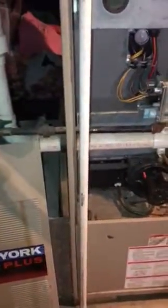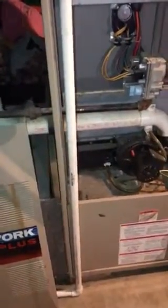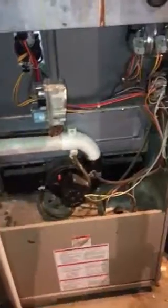So our return drop, I've got the dimensions on the return drop. Bring a vibration collar. New return drop comes down. So our new furnace is going to be much shorter, either 34 or 40 inches. This one, I think, was 54 inches tall.